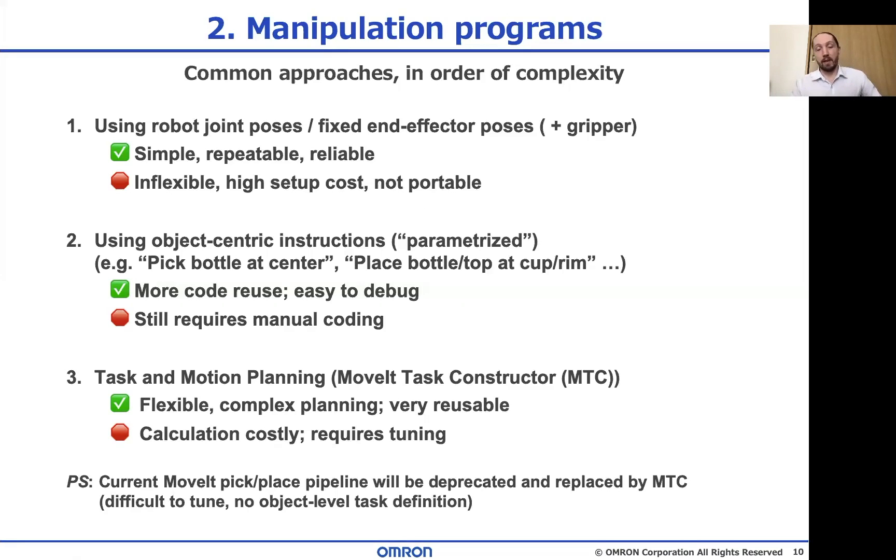The third method is, as far as I can tell, mostly used in research and prototyping at the moment. It uses multi-step planning to evaluate, for example, if a grasp pose will cause issues further down the line when you want to place it, or if a re-grasp will be needed. I think this approach is not very widespread for mainly two reasons: one is that it's difficult to run in real time, and the other is that it's not very easy to set up. Robots are already complicated enough. Systems may still use additional techniques like impedance force control to insert a peg, or visual servoing to find a hole or a target, but those generally sit on top of or outside of these parameterization methods.